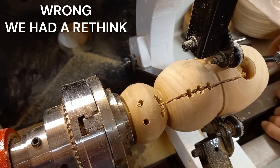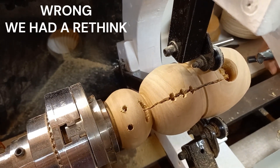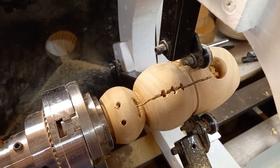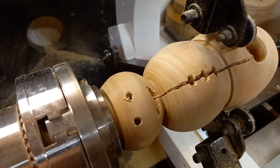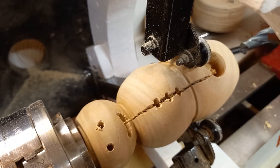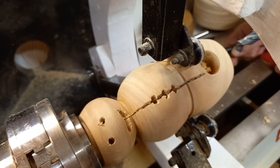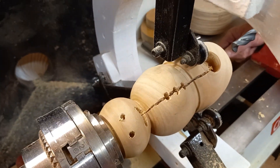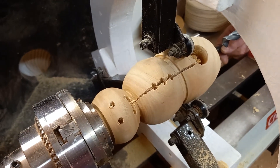We're going to fill it with polyurethane foam glue, and then work it back and probably put epoxy resin over the top of it. That's to be decided yet, but you can see how it's cracked quite deliberately. We're boring it out inside, hoping that by boring it out it can air on both sides, and hopefully it won't crack anymore, but we're not sure. It's our own fault for using green timber. If we'd got on and done it straight away, we wouldn't have had this problem.